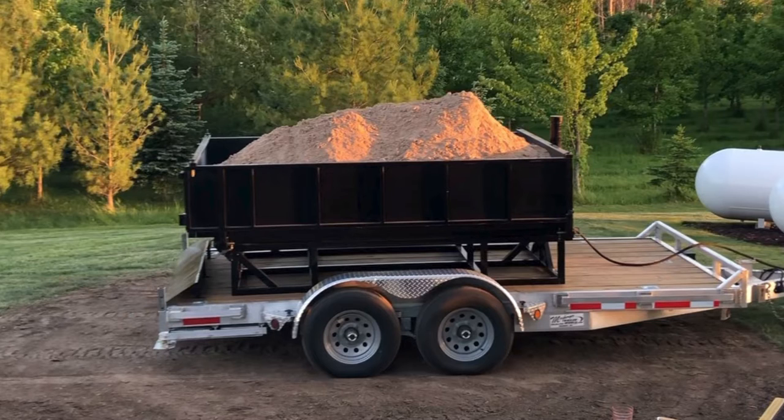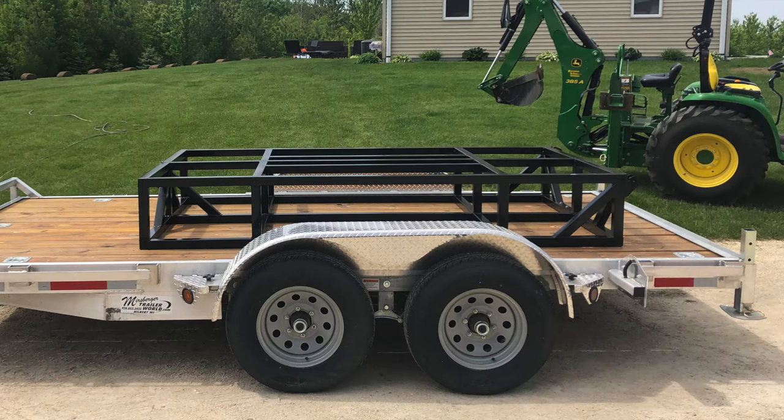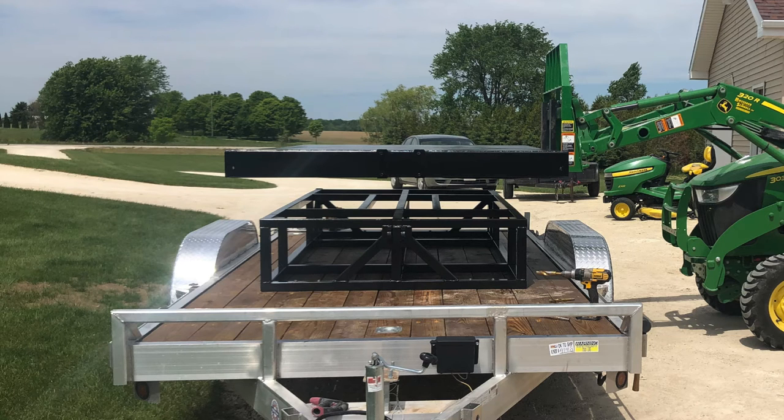Let's take a quick look at how this all comes together. I made a frame out of 2-inch tube steel. I actually made a model out of wood first to figure out the dimensions, where I wanted the forks to go in, and where I thought it needed extra support with some 45-degree angles. Then I made the top platform out of tube steel as well, but with heavier girders going the long way — a 2-inch by 6-inch — to carry all that extra load.